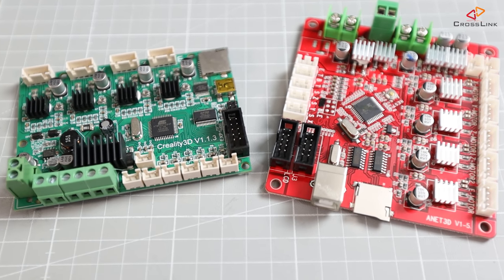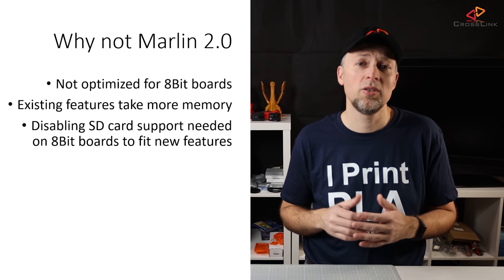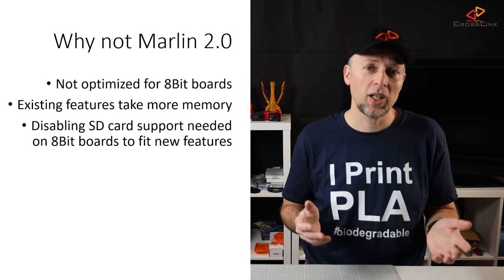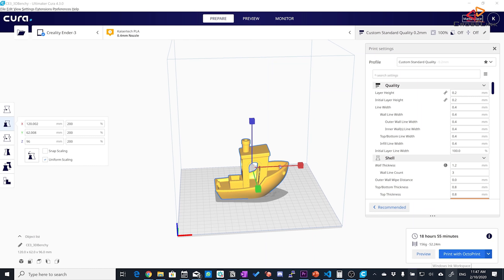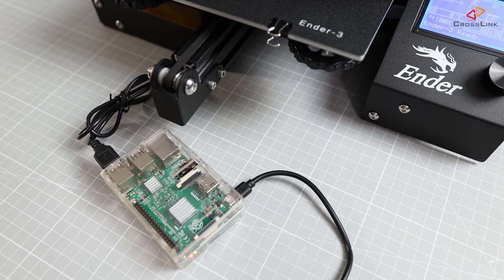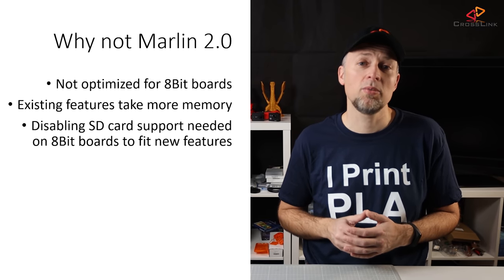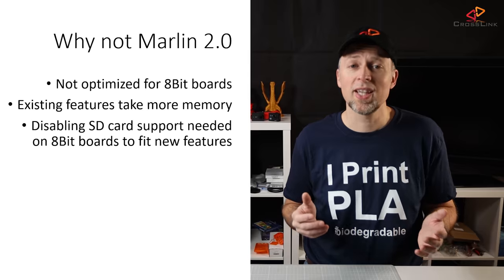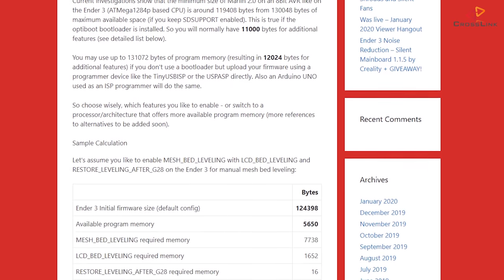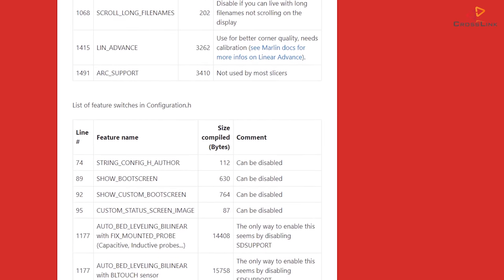I definitely can say that a lot of you will have to disable SD card support if you want to use Marlin 2.0 and find another way to control your printer, be it either directly from your computer using Cura, Pronterface, or using your Raspberry Pi with OctoPrint or another solution. I've also done some more research on the topic of memory consumption in Marlin 2.0 on 8-bit boards and wrote a blog post with more details and a list of features and their memory consumption. You can look it up in the description of this video to learn more and how to mitigate.